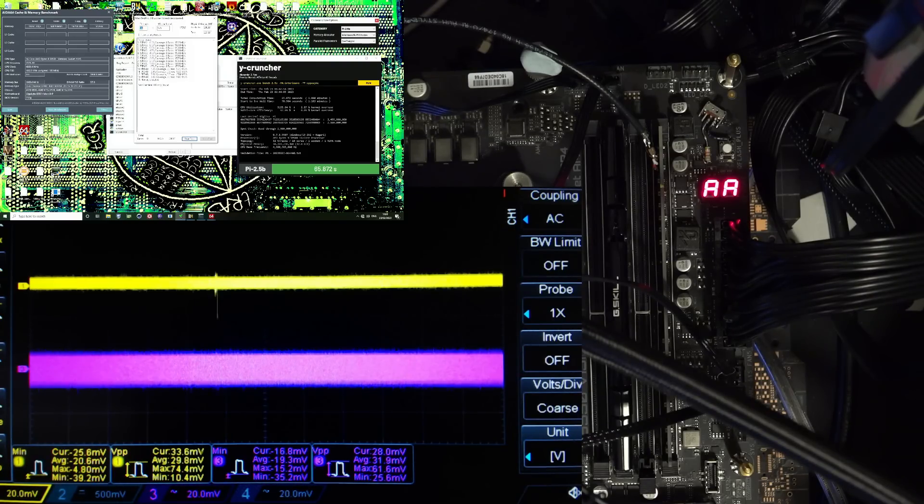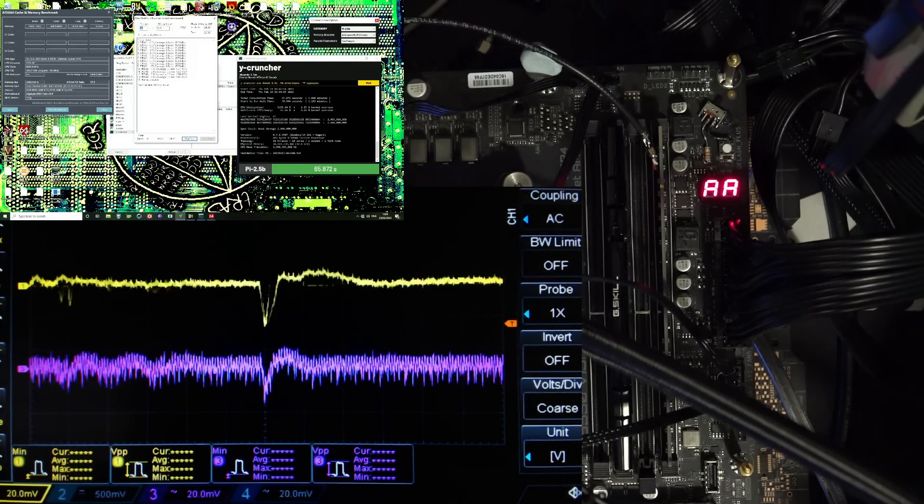You can already kind of see that with the two traces on the oscilloscope. The yellow one is from the memory controller, the pink/purple one is from the memory stick. At idle we do have quite a lot of spikiness, which most of that is just Windows doing Windows things — any time anything needs to get done, the memory controller basically pulls in a bit more power. I'd say it's probably the memory controller causing all of this, because if we zoom in on some of these spikes and do a single shot...